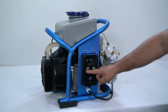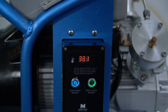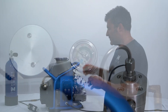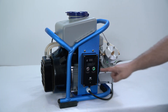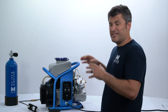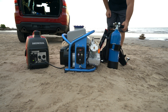Even though the compressor is very simple to operate, we have to be mindful of safety, and we've built in a lot of safety features. What can happen? We can overheat the machine or overpressurize it. If the compressor is running too hot, it will shut off automatically. If the water cooling system stops working, the compressor shuts off automatically. Even so, the operator needs to pay attention to the operating temperature and operating pressure of the compressor.